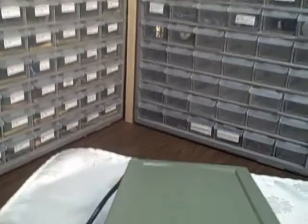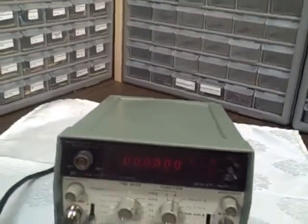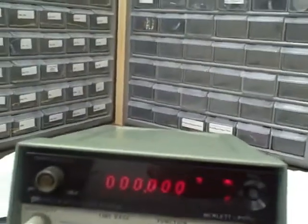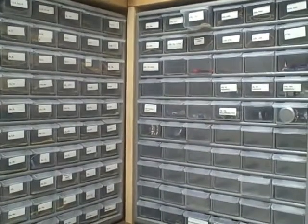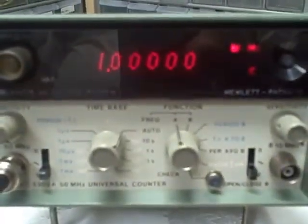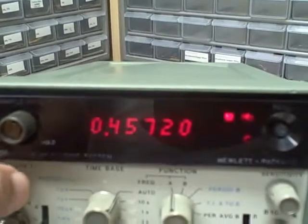What I'm going to do is operate it from this PTS-500 signal generator and choose the frequencies I want — I can dial them down to whatever I want. I'm going to turn off the light here so we can get a better look at the display. We're going to go to channel A, and right now we are running in one megahertz. As you can see, we are reading one megahertz. I can turn the sensitivity down — we don't need that much.